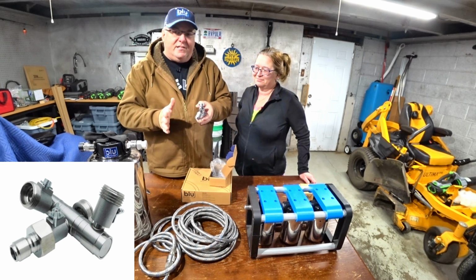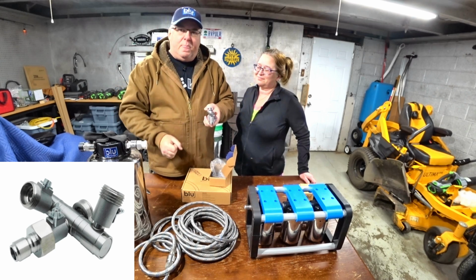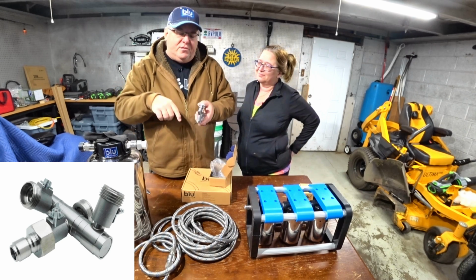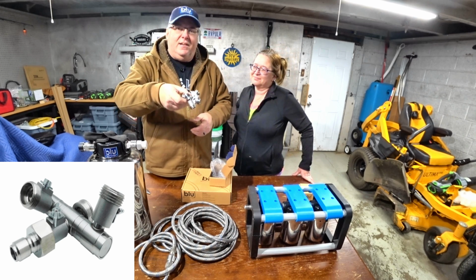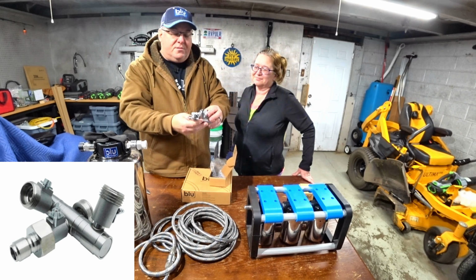Or it's right up against the pole that it's mounted to. Those hose bibs usually are just plastic PVC pipe, and then it's got a regular garden hose hookup, and it's right up against a board that has clamps on it and everything else. This will allow you to connect to it, and you can pivot this in the direction that you need for your hoses so that you can keep clear of whatever obstacles you've got.